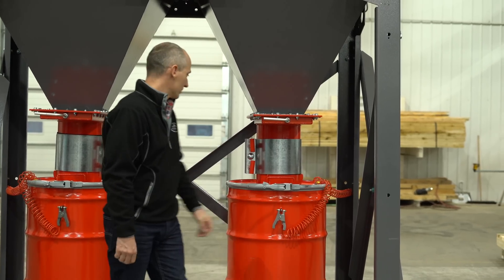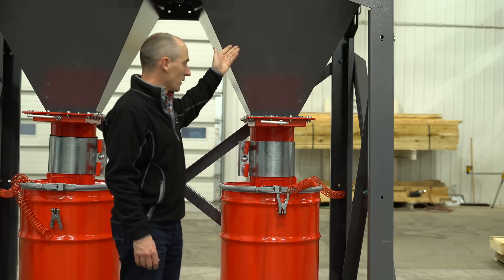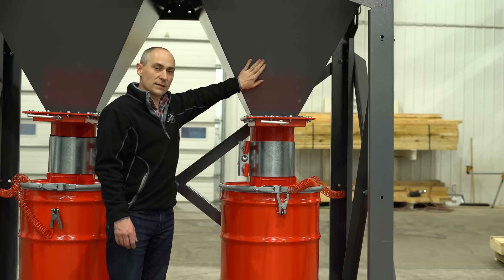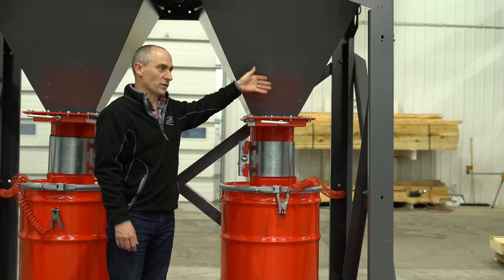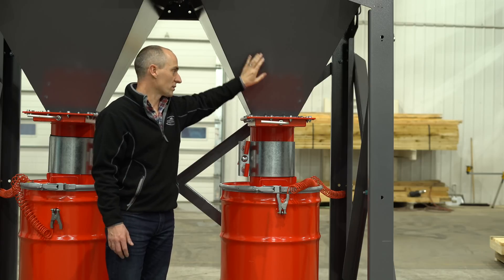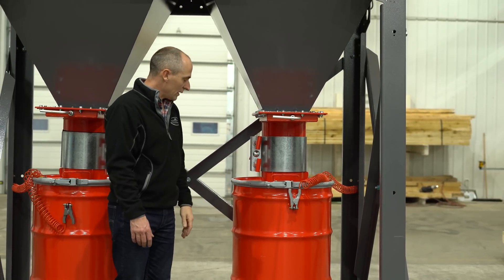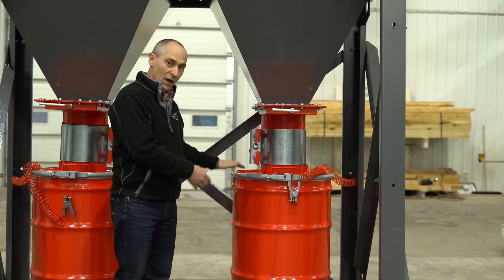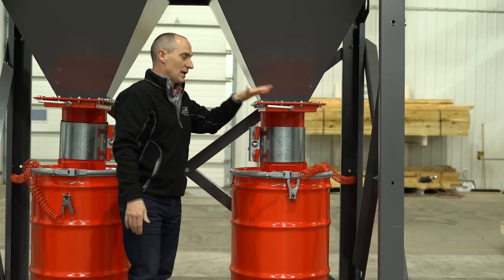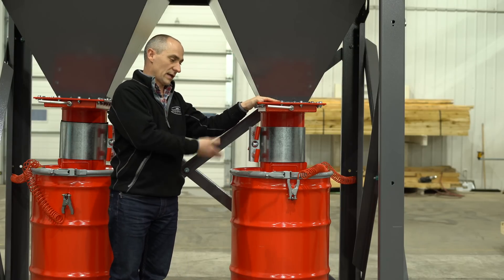To access the drum, when you're running your dust collector it's important to always make sure the hopper is empty from debris — you don't want your filters re-entraining the dust and debris they already cleaned off. Always make sure your slide gate is open so that debris falls down into your hopper. When you want to access your hopper while leaving the dust collector running, simply close the slide gate, which allows the dust to settle out.